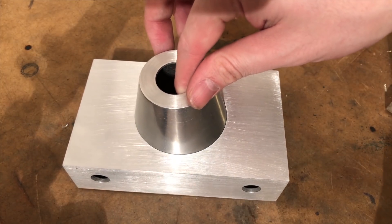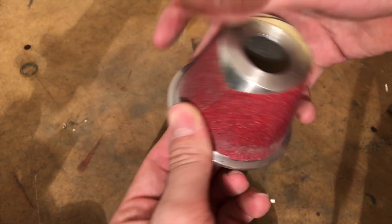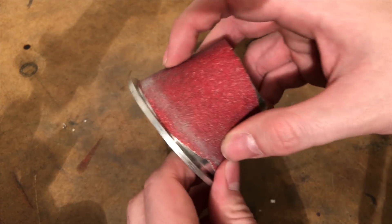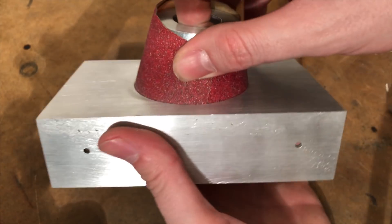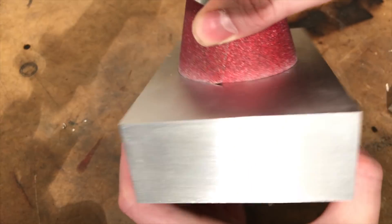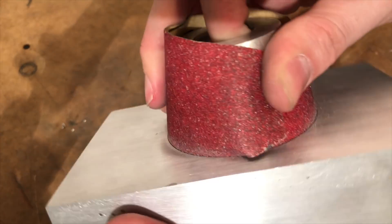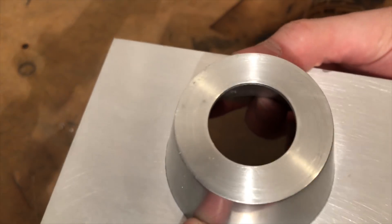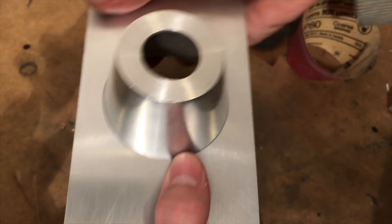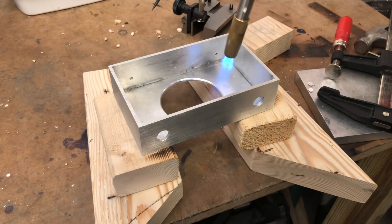Finally, it's time to mount the nose cone. As you can see here, the opening I made is just a tiny bit smaller than the nose cone. This was done intentionally. What I'm going to do now is kind of like lapping — I wrap the nose cone in sandpaper and start twisting it. I check often to make sure I didn't go too far. When the hole in the body is only a few thousandths too small, I can permanently bond the two parts.